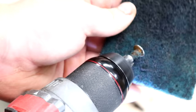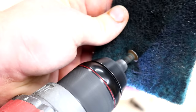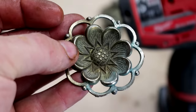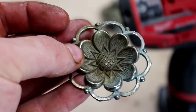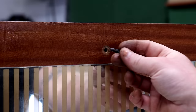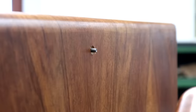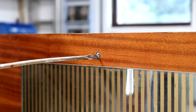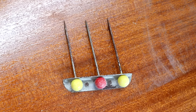These handles had dry and rusty bolts so I added some oil to the threads and chucked them up in my drill, using a scouring pad to clean off the rust from the head. There wasn't really much I could do with the handles themselves because I think they have a plated finish so I didn't want to risk sanding or buffing them. Besides, I quite like that green tarnish on them — it shows their age — so I just wiped them down with some soapy water to clean them up a bit and dried them off before reinstalling them.